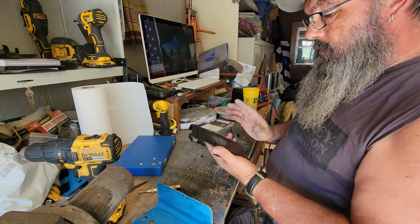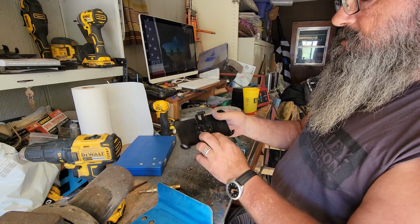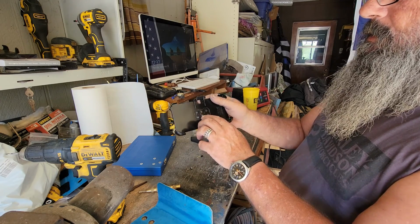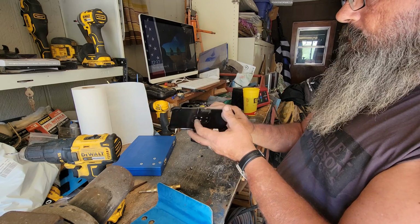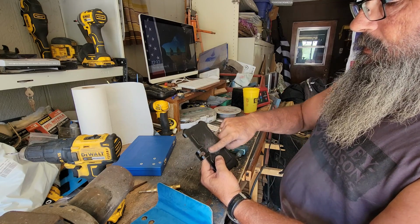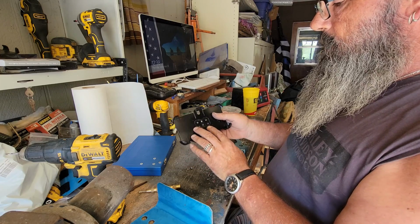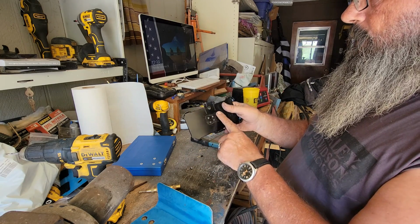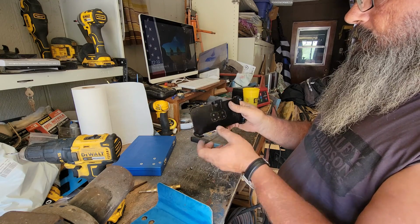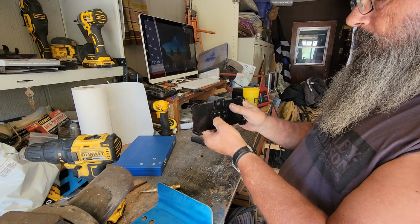All right, when it comes to this holster, it's got a belt clip here with the rotating device on it. All you have to do is on this side, you can peel, it's like a fuzzy sticker here. You peel that back and you've got two retainers here. Use a little screwdriver, pop them out. Then I went back and just used a sanding disc and smoothed this out to where it's flush with the back. And then what's nice about doing that, this recessed area where that tape was gives you plenty of room for your rivet heads to be below the case surface so your phone's not rubbing up against them.